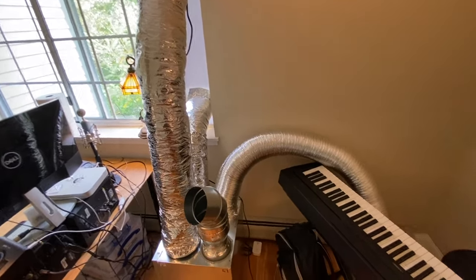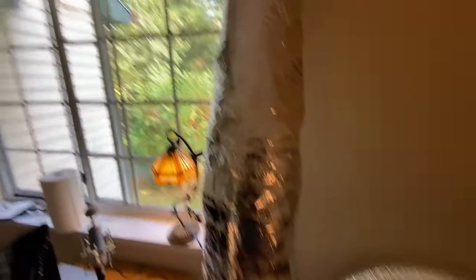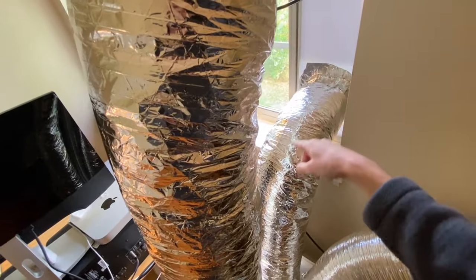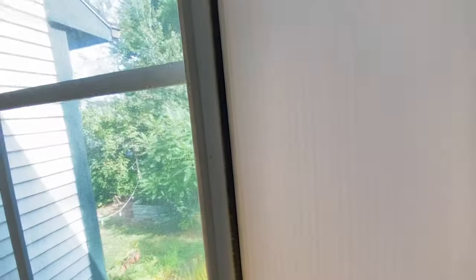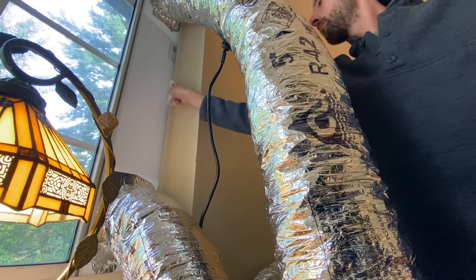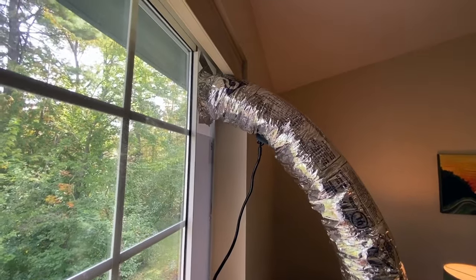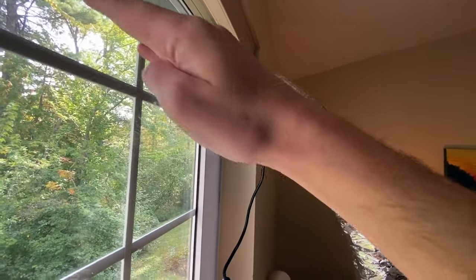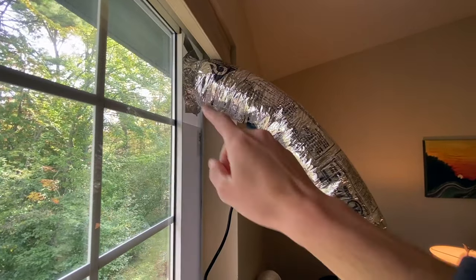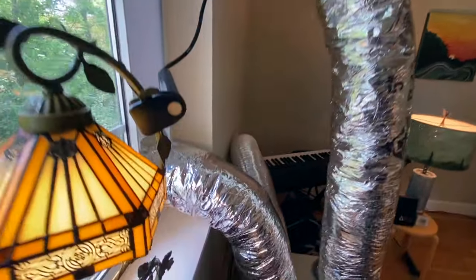I made sure the insert is flush with the window to form a good seal, and I apply weather sealing tape after cleaning the insert with alcohol to seal any gaps. Because of the way the soffit vents are facing, the stale air gets blown outside in one direction and the fresh air gets sucked from below in the opposite direction. It's extremely important to have gradual curves in the flex duct for proper airflow — no sharp turns.